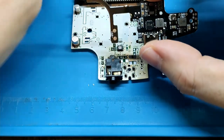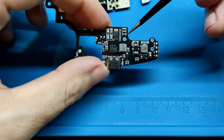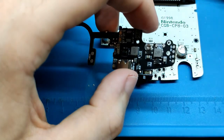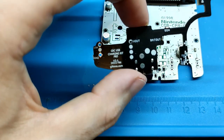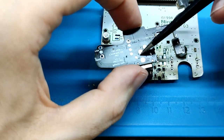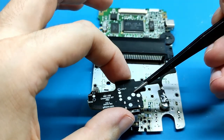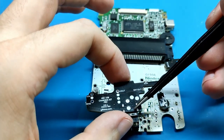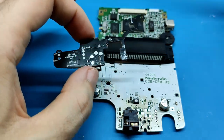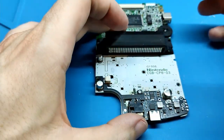We have to solder in total one point, two points, three pads, four and five, and there are two optional pads that we can solder if we want. That is these two, this and this. This is not only this, as this, because of the camera. Let's see. These two are optional, and you can solder here only to make the board stronger. But you don't need to if you don't want. I think the other five are strong enough, but you have this option.